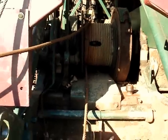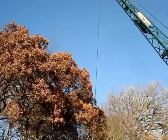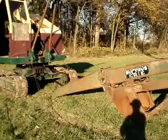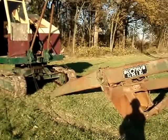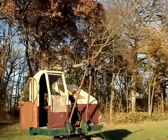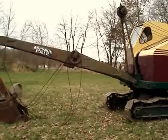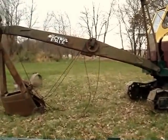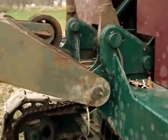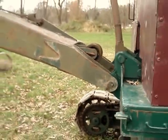We're getting a little closer — I got the A-frame in place and the 22B is holding it up right now. I managed to get the pins in, did that all by myself. Got the backhoe boom in position here, though I'm going to need some help for that part — it's pretty tough. Next I'll be reeving up the cables on the A-frame; those are the boom hoist cables that hold it in position. Once I get some help we're in the home stretch. We got the boom in position and were able to get the pins in without too much difficulty — not too bad when you have some help.